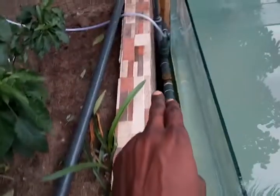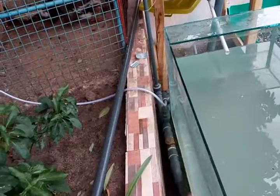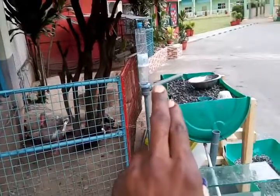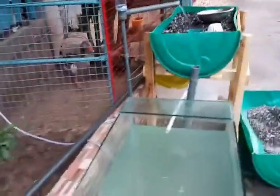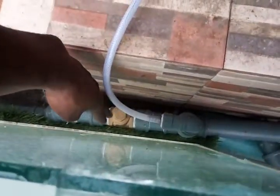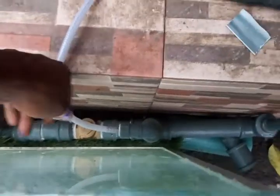It has 8 millimeter thickness, and this is a two-inch pipe coming out from the bottom, sending it that way to the point where we have the hose to inject air. That's it again on this side. And this is a 50 mm check valve — air goes in here, goes into this pipe, and comes up here.